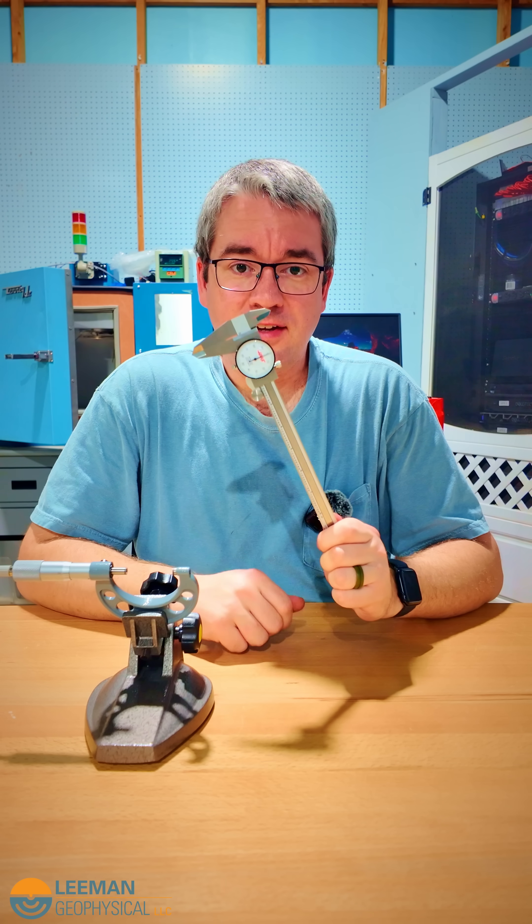We of course have a full set here for inspection. So do you need a micrometer in your lab? If you're dealing with tight slip fits of parts, or you need to know the diameter of something or groove width or anything better than about a thousandth of an inch, you probably need one. If a thousandth of an inch is good enough for you, then a set of calipers — maybe a six inch or an eight inch pair — may do the trick, and that's what you need to know about the difference between micrometers and calipers.